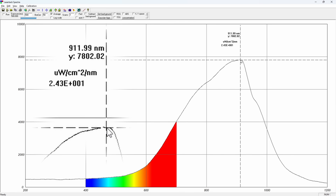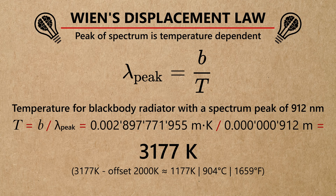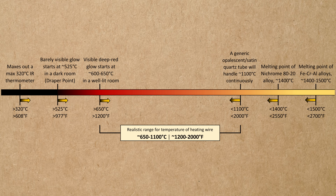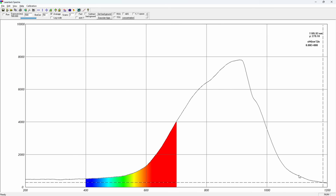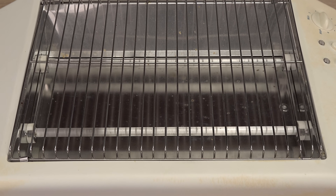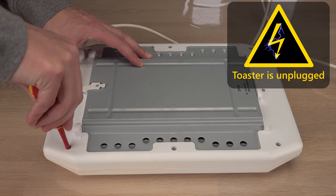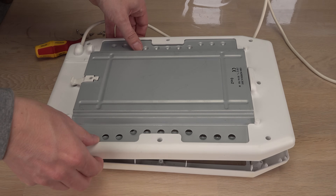The toaster spectrum peaks in infrared, indicating a lower temperature than in the light bulbs — around 912 nanometers, equal to about 3180 K. Minus the offset from the lamps, that is 1180 K, or 900 degrees C. That's within the realistic range based on other observations. However, there's a steep drop in infrared above 930 nanometers, which looks like something is filtering the spectrum, possibly giving a false peak — possibly the opalescent quartz tubes encasing the glowing metal wire.